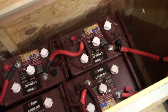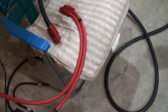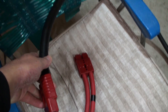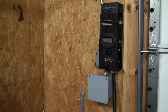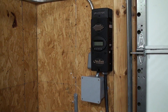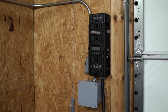I've got my two cables, 48 volts, coming off that pack into a high-amperage quick connector. The cable runs over to my charger. I've got an Outback Flex Max 80 charger on the wall. When you plug it in, the charger powers up, and within about 30 seconds or less, it's on and working.